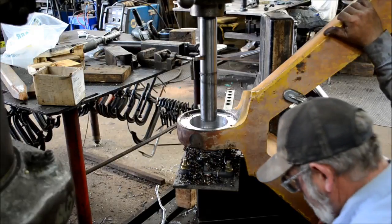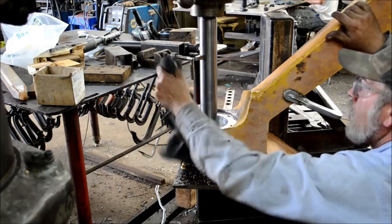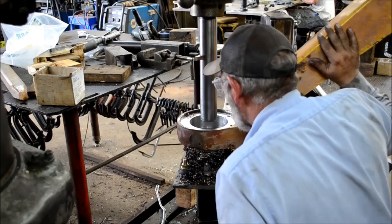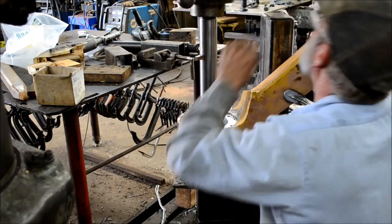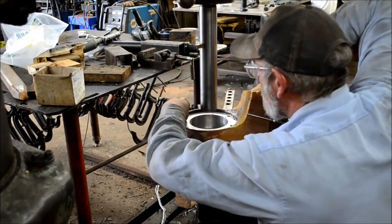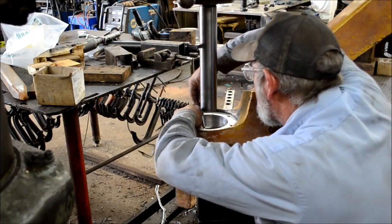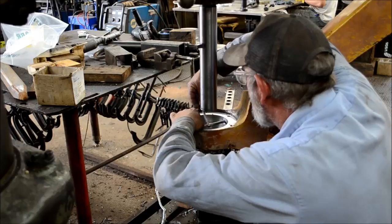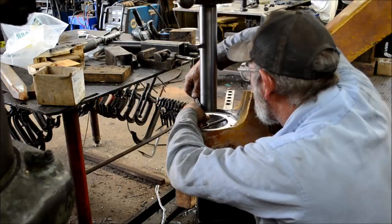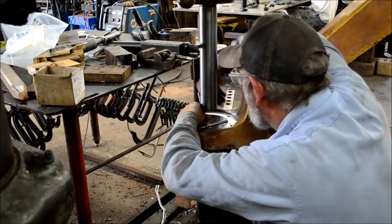Get the tool facing the direction I want it to. Wipe the oil off the boring bar. Now I need to get a measurement of the bore. It's kind of tricky with the telescopic gauge and the boring bar in the way. Hard to get your hands in there the way it needs to be. Hard to get the telescopic gauge set in there at about the right angle so I can push it through center and get an accurate measurement.